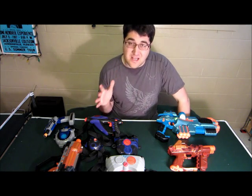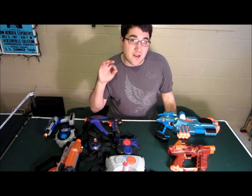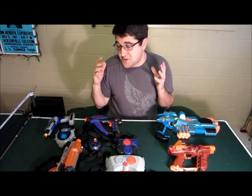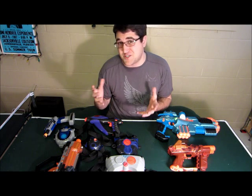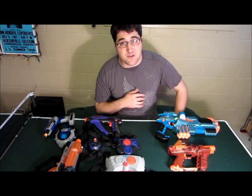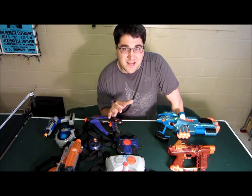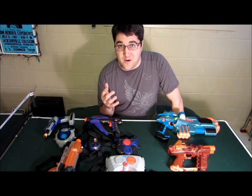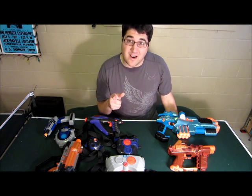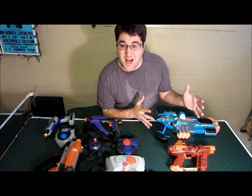from each blaster. Lazer Challenge, or laser tag in general, works by sending coded IR beams of light to a sensor, and the sensor is hooked up to a board which is designed to recognize certain signals as a hit, or as a multi-hit, or as a reset, or whatever the signal is programmed in that chip to be. Now, Lazer Challenge systems aren't quite as picky when it comes to receiving infrared light signals. That's why they receive more sunlight interference, and that's why I'm going to show you how they can be utilized with LTTO and LTX blasters.